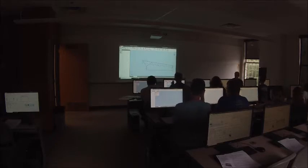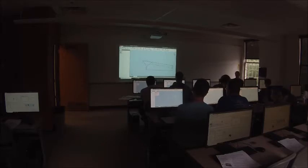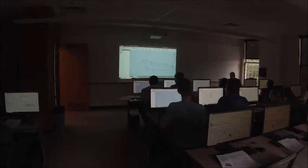Now this is the useful thing about having a layout sketch, right? You can just go in and measure this stuff once you've already designed it so it'll work. The layout sketch gets all the geometry so the geometry works, and then you just use the measure tool to figure out dimensions that you need, then you go model your parts. Now if you have to make a change, you make a change to your layout sketch, then you have to change your parts, right? Which can be kind of a pain in the butt. There are other ways of doing it, but they tend to end in disaster, so this is the way I always do it. And I just make it right the first time because that's something I can do. You will always have to change it. You will always go back to it.